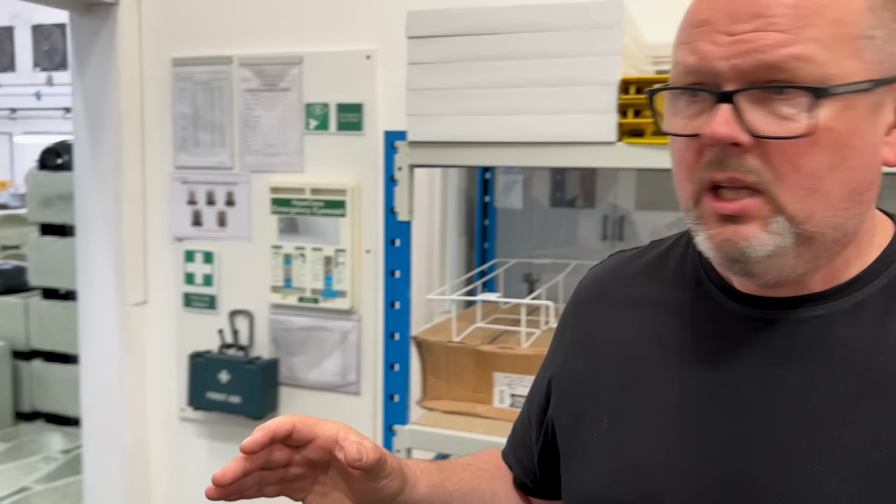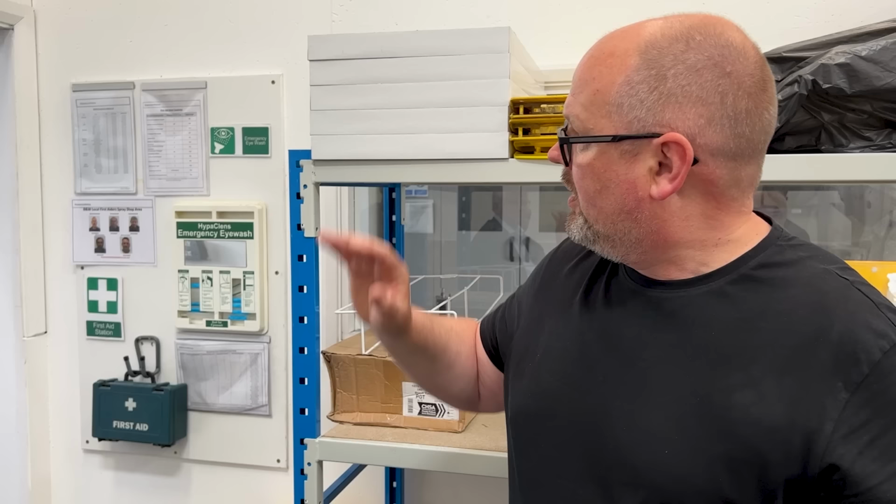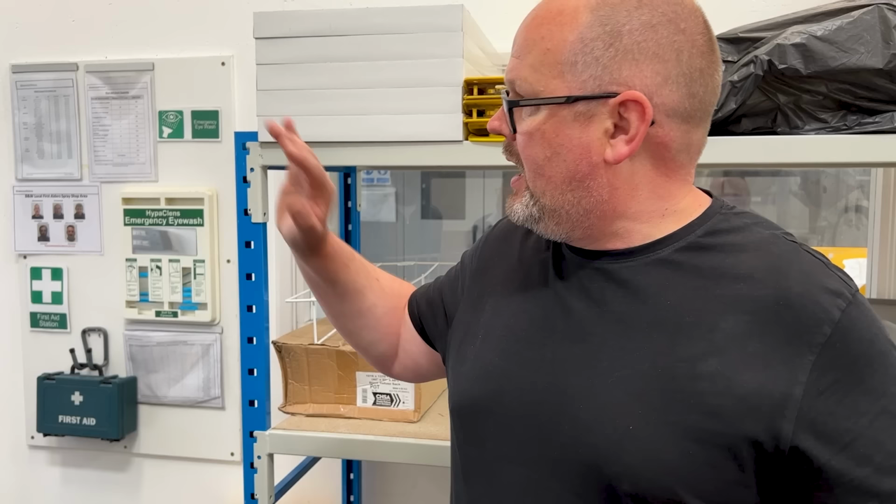So anything smaller that's painted by hand, as opposed to painted by the robot, is prepared here. So if you look behind you guys, you can see a box that's over in the corner of raw metal heads. Again, they come to us from a supplier, in this case inside the UK, because it's a very substantial metal component. We don't want to be shipping that too far. It's cast rather than milled from solid. Obviously they get quite big, turbine heads, so you don't want to take a single billet and machine that away. You've got 18 kilograms of aluminium left over. They will come in here and they will be surface prepared. So we'll sand them down and we'll get them smooth, and then we'll get them ready to receive paint.